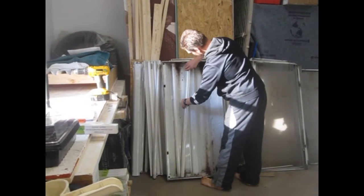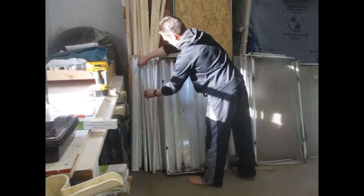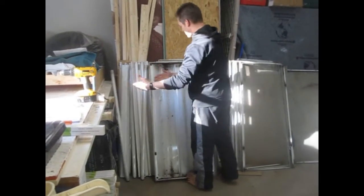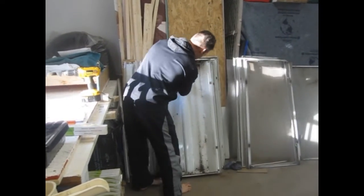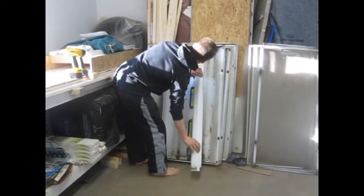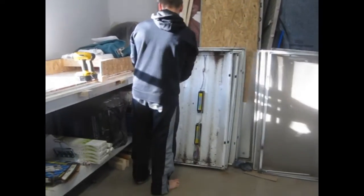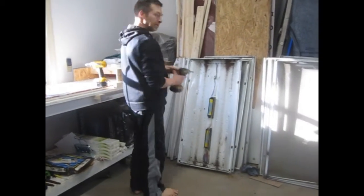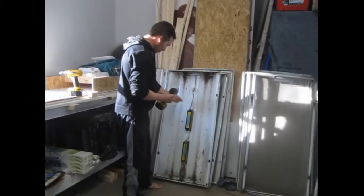Okay, get the rest of the bulbs out of there. I hate it when people go through a long video and show you stupid things. So I'm not trying to take a long time to do this. I tried to set it up so it's pretty easy. Take out the extra reflector part. Now you got these ballasts in here. Don't need them with these cool LEDs, so bye-bye ballasts.